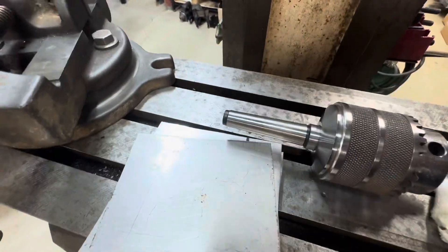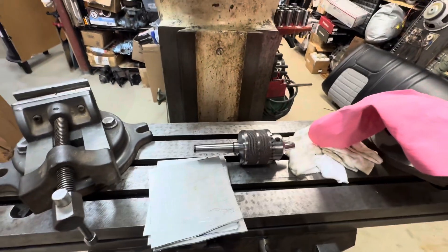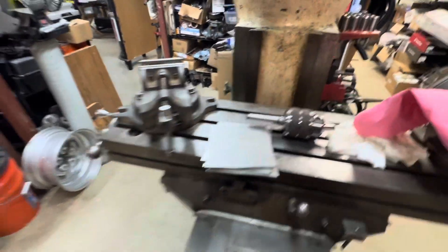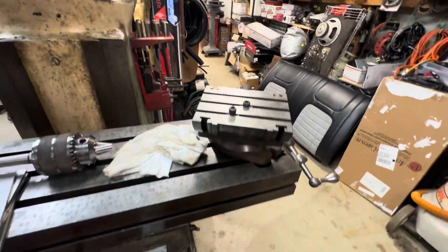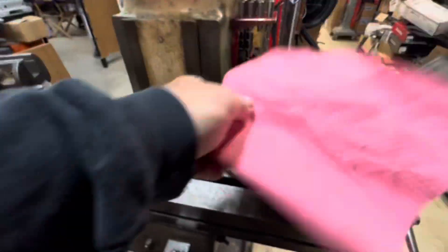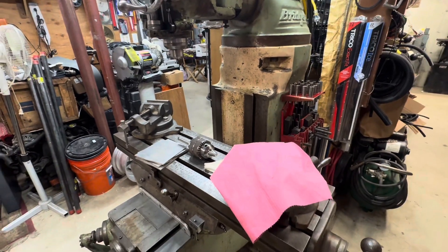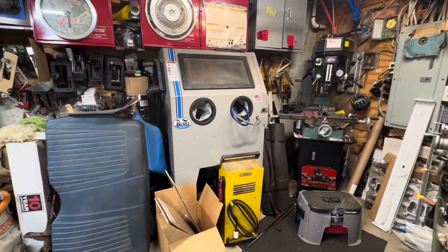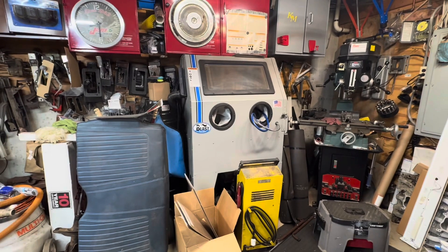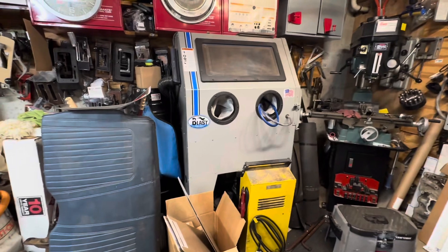I'm outfitting this machine — I bought a big drill chuck off eBay for about $40, and an adapter to go from number three Jacobs taper to number two Morse taper for about $10 on Amazon. I've collected some vices through the years and brought them here from my shop. It's an oldie but it runs nice and quiet, and hopefully I'll have many years of enjoyment from it. There's my sandblast cabinet — I bought it new when I was restoring my '67 442 convertible.